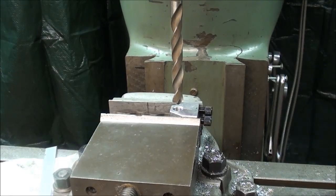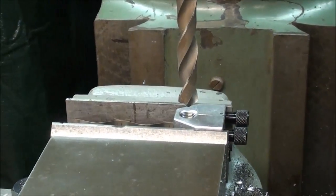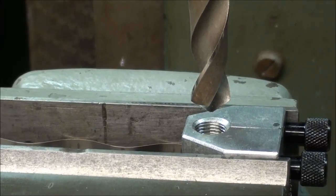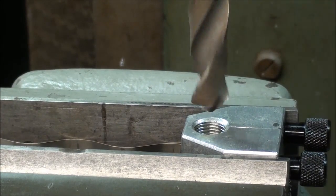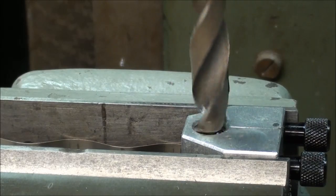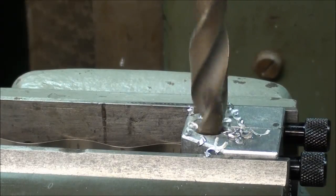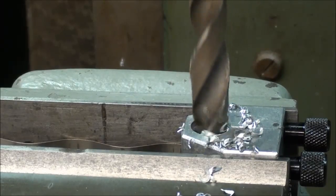Be sure and roll up your sleeves and wear your safety glasses when you work on these machines. I've got the work mounted as I just showed you, and the drill bit mounted. This larger bit I'm going to run in back gears at slow speed — and remember, on a Bridgeport in back gears, you have to run it in reverse. Just take your time and drill it slowly so it doesn't grab, get pulled out of the vise, and ruin it.